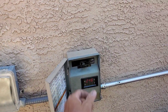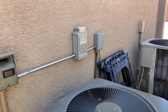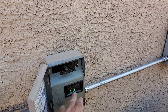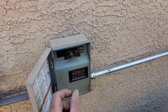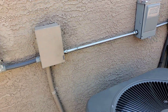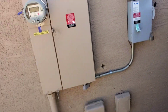Right now I'm getting robbed — it's pulling more from utility power than it is off the solar. These current readings might be a little high when you clip the sine wave like you do when it's just pulling power at the absolute peak. But still, it's pulling off grid when it doesn't need to be. So let's go see what's going on with the Solar City Tesla system.